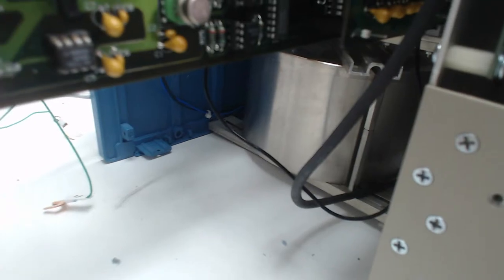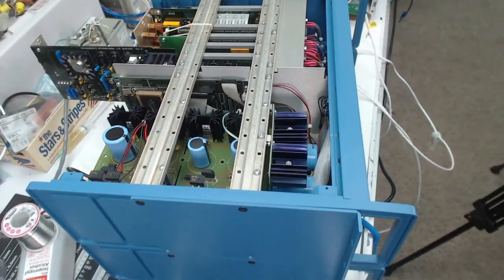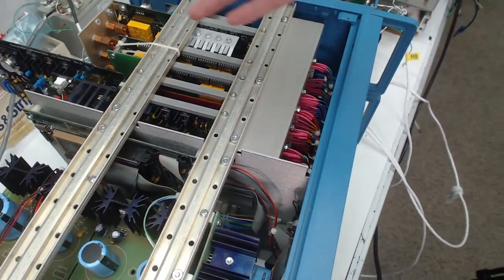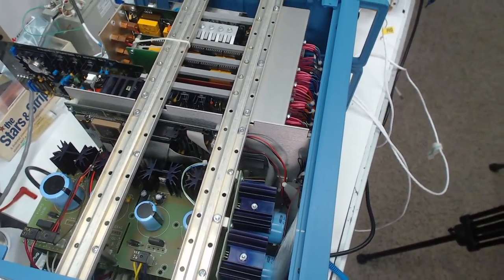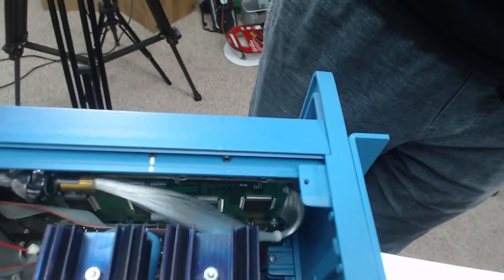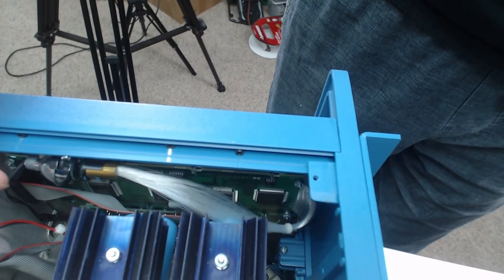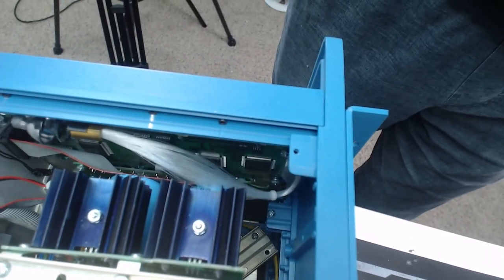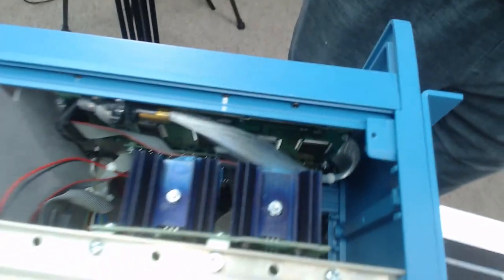I'm not sure if the camera actually shows it or not. So, that's how it's built. It's quite modular, so you can extract any of these boards and do some troubleshooting, especially using the extender like that. Very nicely built. And then the interesting part is there is a lamp, actually an incandescent bulb in the metal heatsink with the infrared filter and a fiber optic cable with a bunch of strands. That's the backlight for the LCD. So this is all fiber. It's very unusual to see.